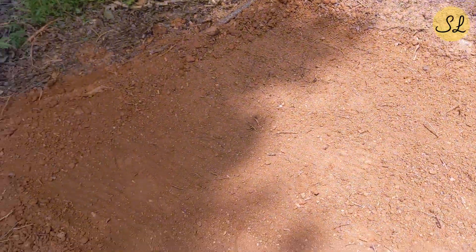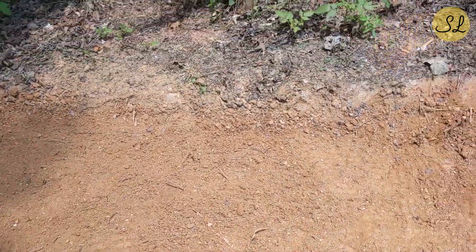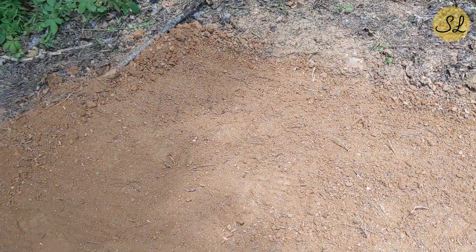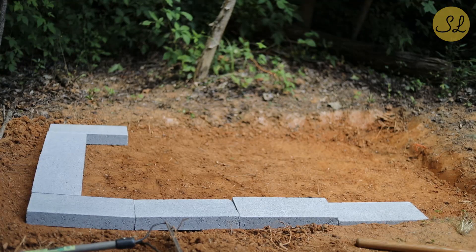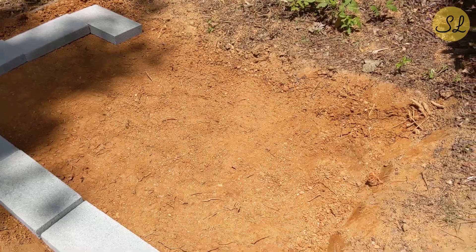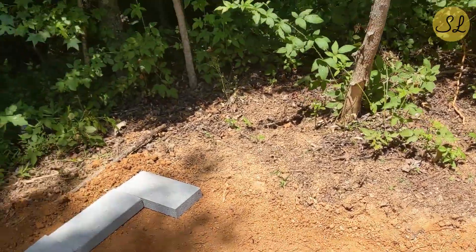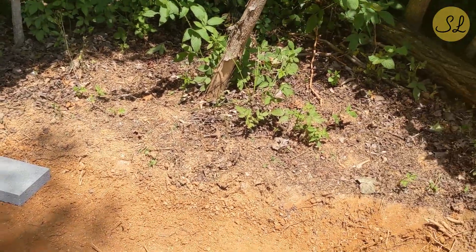So now a little bit more digging and leveling of the hole — it needs some work, you can see it's not perfectly level, there are some bumps. I'm just going to clean that up and then start laying down the bottom flat cinder blocks. I've started putting them down to dry fit and I'm adjusting the blocks to make them level using the rubber mallet. One here is a little low on one side, this side is high, so I can build that one up and get it all level.